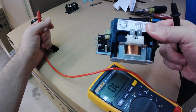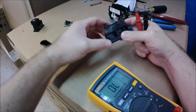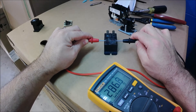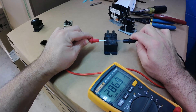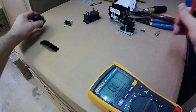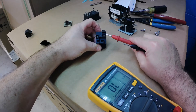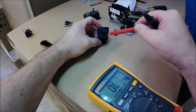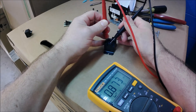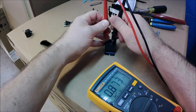These DC relays, though — if you pop that little rectifier off, you can check the coil of this DC relay and get 286 to 287 ohms. There's actually a coil of wire in there, like you'd think of on a traditional contactor. And if I ohm out the DC relay on the Warren heater kit down at the bottom, it's not 0.8 ohms — it's 0.8 kilohms. So we have to move the decimal place over. We're talking about 873 ohms.